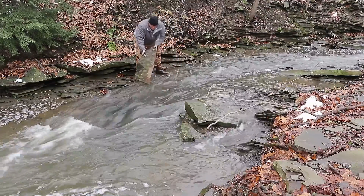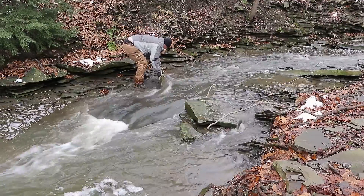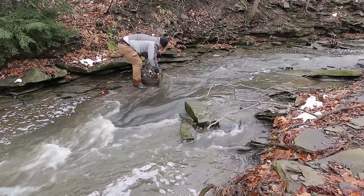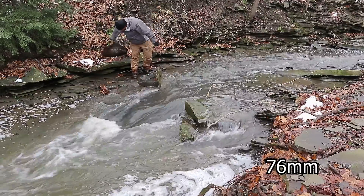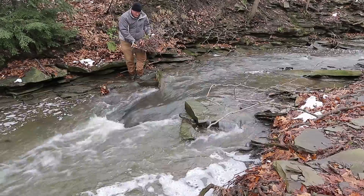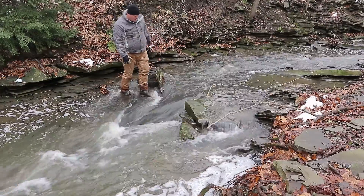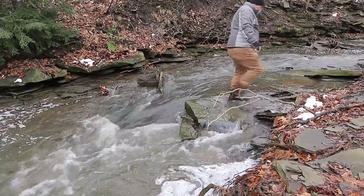It's meant to be used in deep, fast-flowing water. You can see in the video here that the water is not quite deep enough to fit a 6 inch turbine, so I'm making it deeper by narrowing the channel, which will also increase the water velocity. It's a 6 inch turbine, but the housing is seven inches in diameter and three inches thick, and it's just under three pounds. If you can get the water flowing through it over seven miles per hour, then you will get a full 15 watts of charging capability. It'll work even at slower velocities down to one mile per hour in slower moving rivers or towed behind kayaks or canoes.